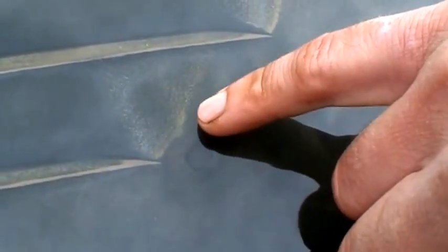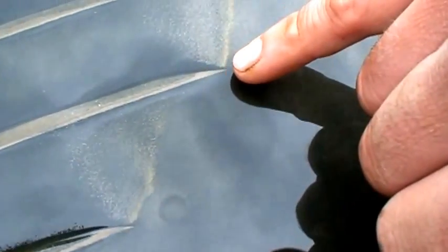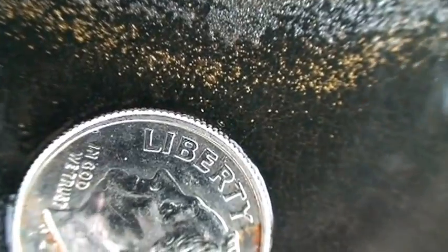You can see here the fine gold coming out in front of the sulfides. The sulfides are going down to the left, the gold is coming over to the right. Out of the edge of every one of these riffles you have your fine gold, and then it gets into the long groove and walks right up the step, right under the sprayer bar. Right at the top of the first groove where the gold has worked its way up to the sprayer bar and gotten washed out, it works its way down parallel to the sprayer bar.